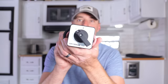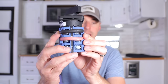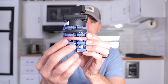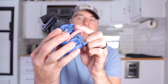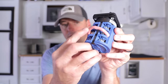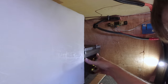Looking at the physical switch, you can see the different positions and the jumpers. On the odd side, there's a jumper between terminals one and three, and between five and seven. On the even side, you can see terminal four and terminal two, where the black wire comes in, and a jumper bridging six and eight.